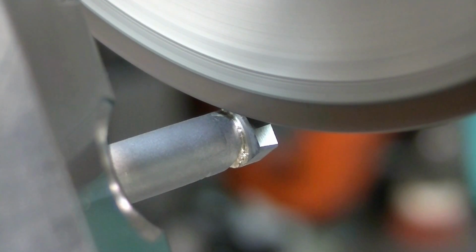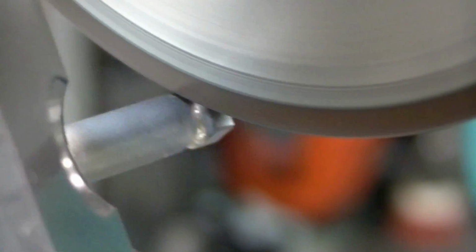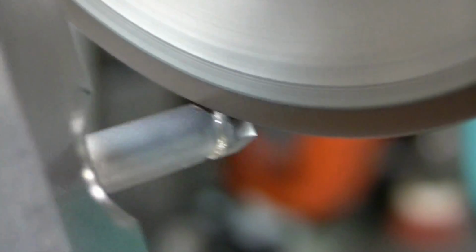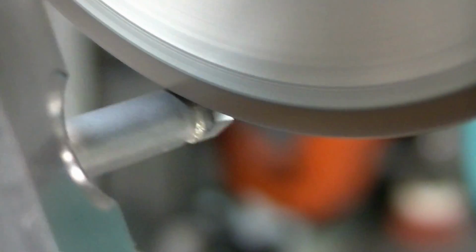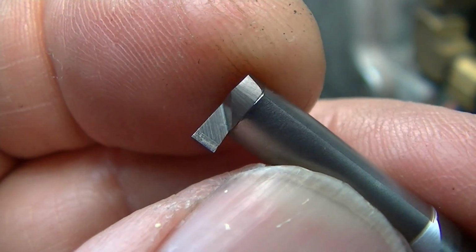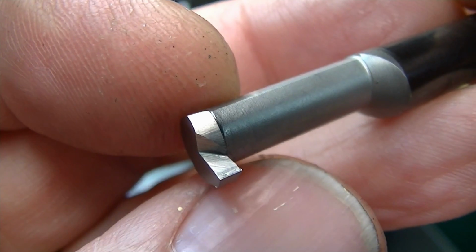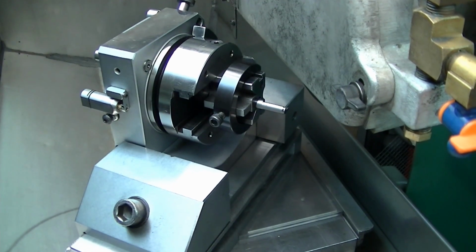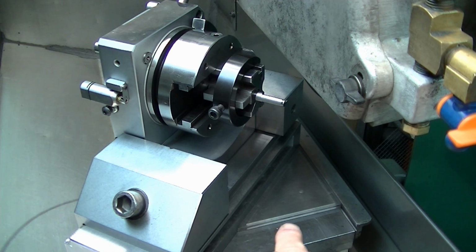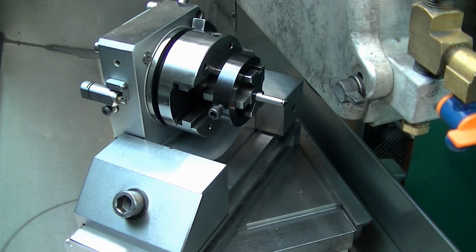Now I'm grinding the flat on the new ones that have the new heads. Plunging and then traversing. Lather, rinse, repeat. Now we need to cut this 45-degree gash through there, giving us the top of the tool. And we have the whole vise set up just like it was. All I did was release the chuck, clean it off, put my 45-degree plastic triangle in here because the angle's not critical. And we're going to go ahead and get lined up to grind that.